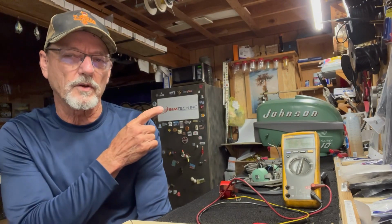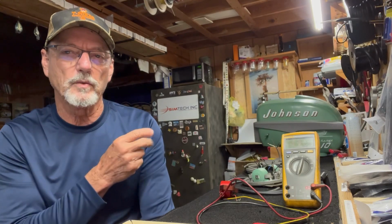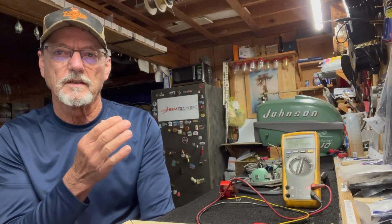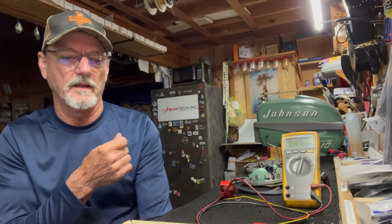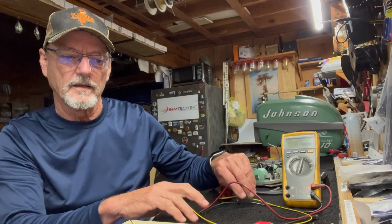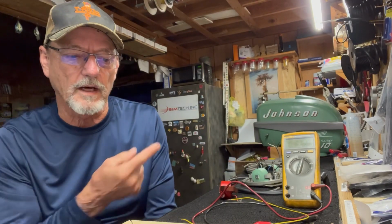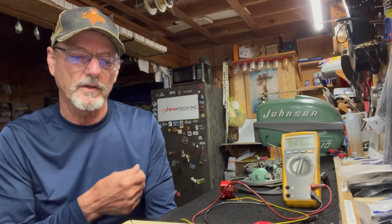How about that? All right, well, I hope you all enjoyed the video. Let's go ahead and summarize right now. So in part 1, we talked about the 2 different types of voltmeters, the analog and the digital. And in part 2, we talked about voltage versus ohms. Voltage is AC or DC, and ohmage measures the resistance of the conductor. Part 3, we talked about what a circuit is when it comes to electricity. And in the 4th part, we talked about the applications. We talked about the voltmeter being used to measure for spark, for measuring coils, for setting the points, or looking for opens and grounds. So I hope I made it clear.